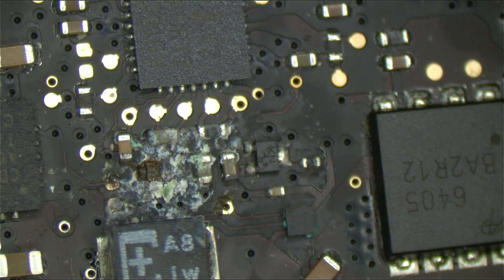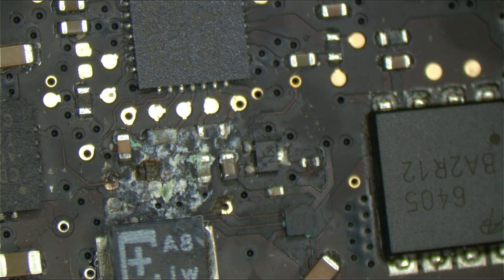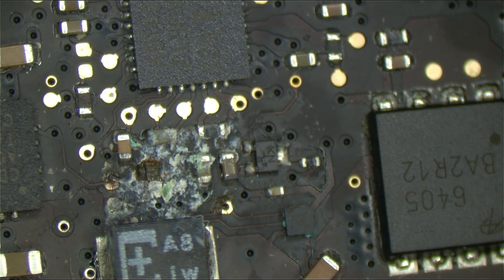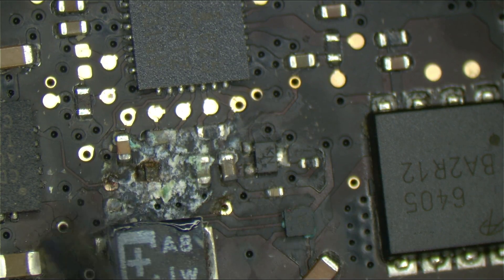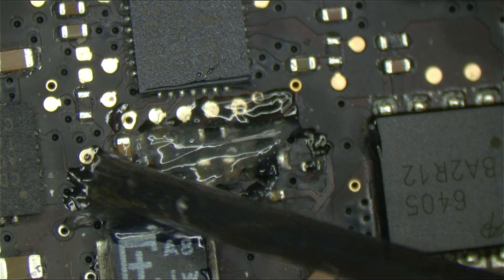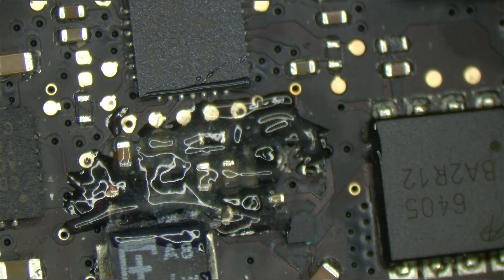So this obviously was never ultrasonicked. And here's the thing with machines that have never been ultrasonicked — usually I don't work on them, but since this is limited corrosion in a limited area, I will work on it, and then I will ultrasonic afterwards just to save myself a trip. I actually ultrasonic these machines after I'm done working on them so that the customer doesn't see a complete flux mess, when time permits and when it's practical to do so. So the first thing I'm going to do is put some flux, get the hot air station revved up, and do what I like to call hitting delete.